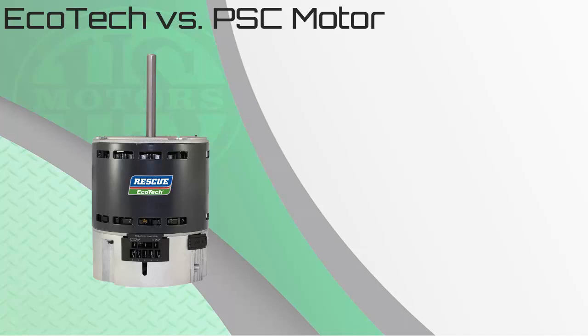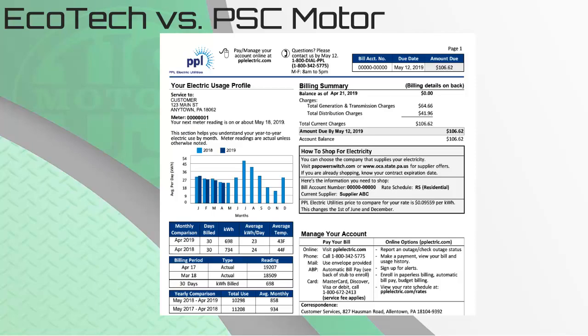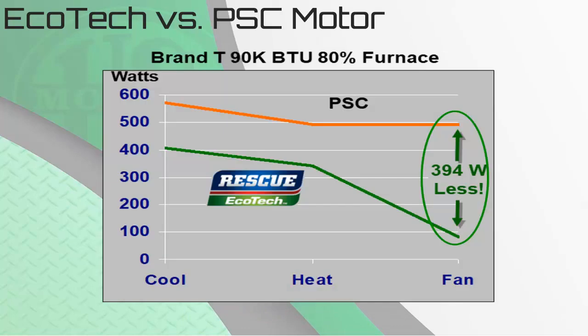First, we will compare the energy used by the Rescue EcoTech ECM to the standard PSC motor installed into the same system and measure the watts used by the motor for cool, heat, and constant fan modes. Keep in mind, electric companies charge by kilowatt hour, so reducing the amount of watts used will reduce the electric bill. The first system we're going to look at is a 90K BTU 80% furnace. The PSC motor is the red line and the green line is the Rescue EcoTech.